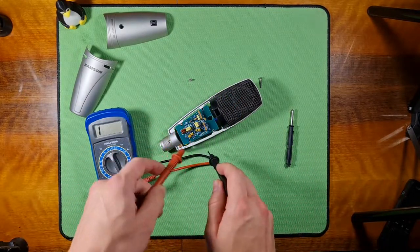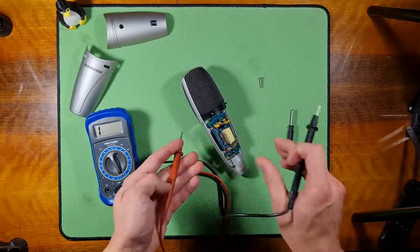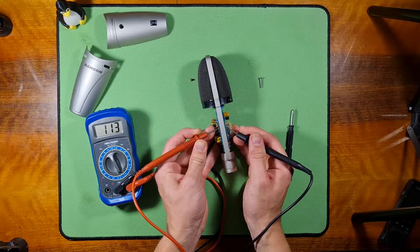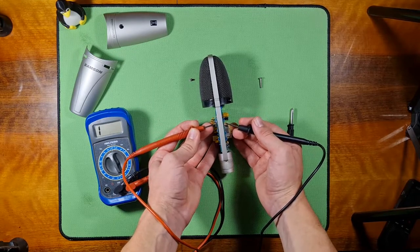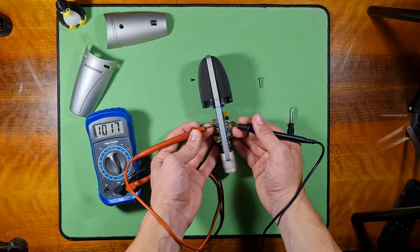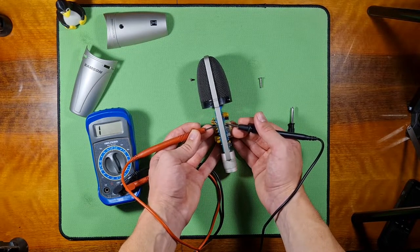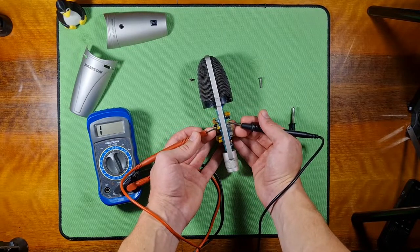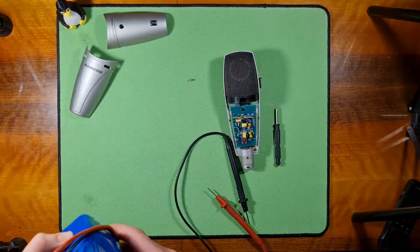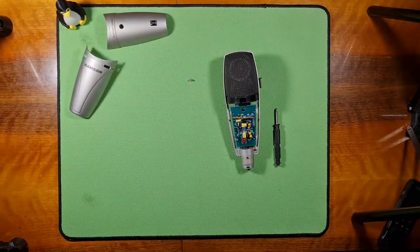So I was going all around the board, and I had the idea to test the jumper connections themselves. I was going through one connection to another, testing all the jumper cables. And on the second one from the top, there was no connection at all. Over here it now beeps very nicely, but there was no connection. I started pushing it a little bit and looking around it, and I found out that there is a very bad connection. And actually, there shouldn't be any bad connections with the jumper cable. But for some reason, in this one, there was.